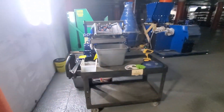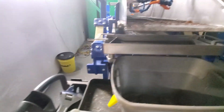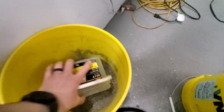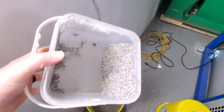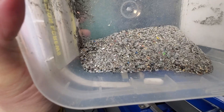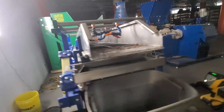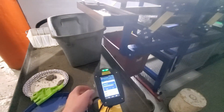Happy Friday! Today we were running some tests on the wet separator for a customer who has a fraction from his e-scrap. This is some material that has some precious metals in it. It started out looking like this here — crushed glass, some copper, little pieces of plated gold. We took these fractions and put them onto the wet separator.